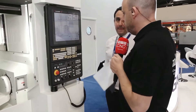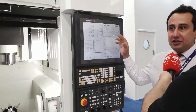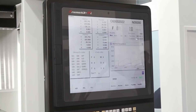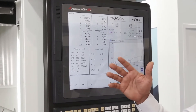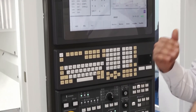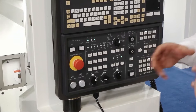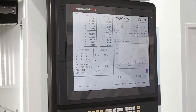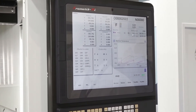There are two other points I really want to pick out — the first is the control system and the things you do to monitor the machine over long periods of time. Can you explain what Kitamura do there? Basically Fanuc control lets you monitor the machine remotely through a software in the control which we call Anywhere Remote. Anywhere Remote connects to the internet through Wi-Fi or LAN cable and gives you updates for any status change in the machine when you're running it unmanned. For example, if you leave the machine running for the weekend and you're running out of coolant, or the machine stops because of an alarm, you would get an email on your phone or mailbox.